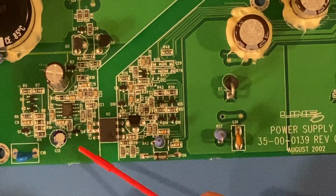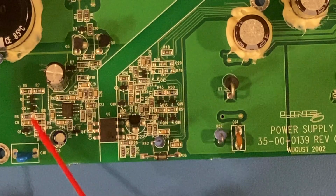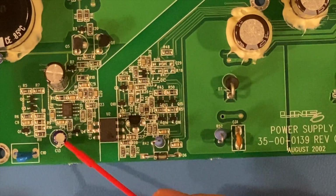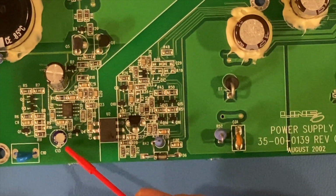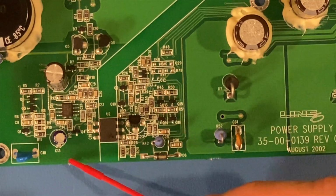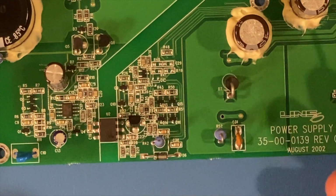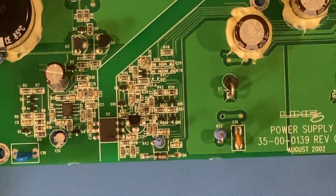Additionally, they're not going to put silicone because you have all of these small surface mounted pieces in close proximity to the capacitors themselves. In doing so, they'd be shooting themselves in the foot, because it makes it really difficult, since caps have to be replaced from time to time. They are a wear item. They do go out. They are designed to be replaced.